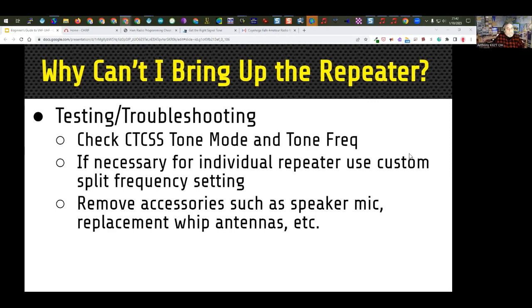And Marty, that brings up a really good point. A lot of the radios, when you program in the offset, you then need to turn the offset on. So some of them require 2 steps. You have to turn on the offset and then set the frequency for the offset. Oh, okay. Yeah. Especially if it's an odd split, then that's going to take some extra programming.